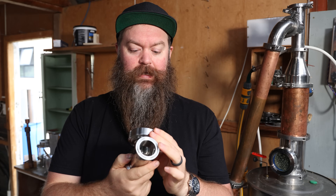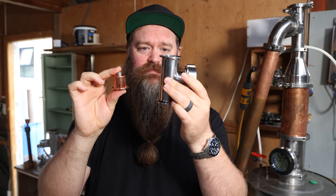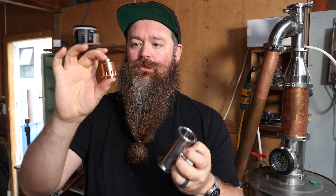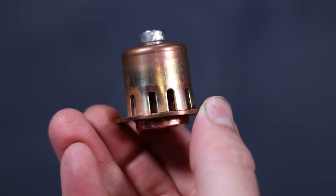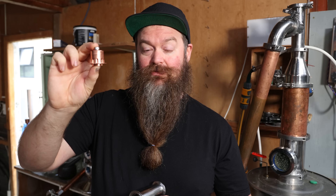The thing that's different to what I've used in the past — I have to imagine forced to be so because we're working on this little column, which means we can't have a downcomer. So the vapour going up goes through a bubble cap, but then the liquid going down is interacting more with a perf plate. I have to imagine that vapour speed is going to be very important when trying to load these plates with the right amount of liquid.